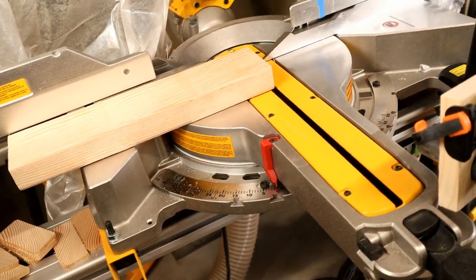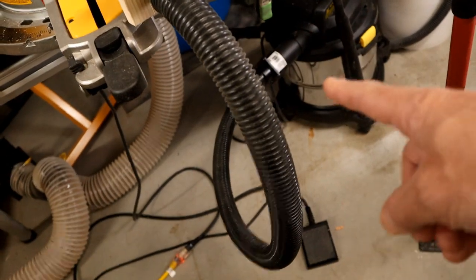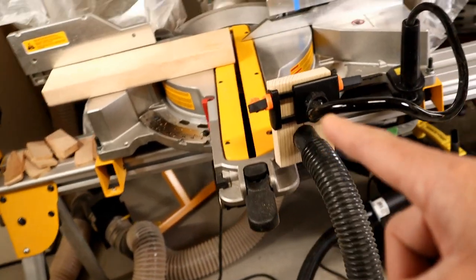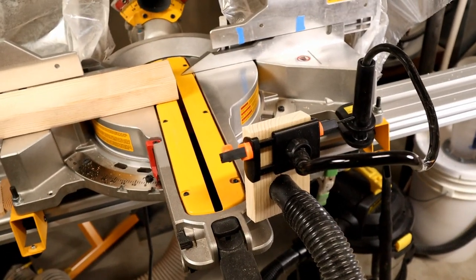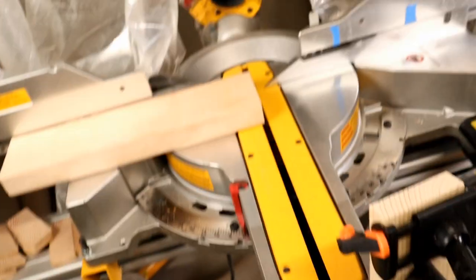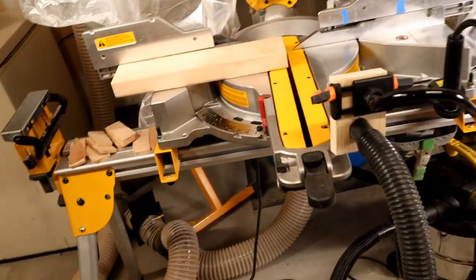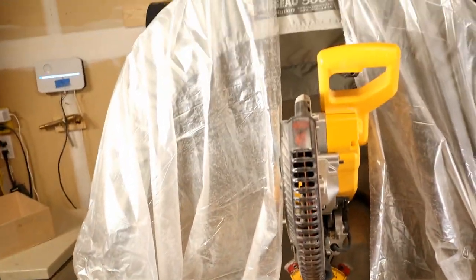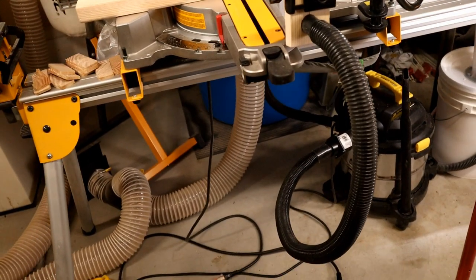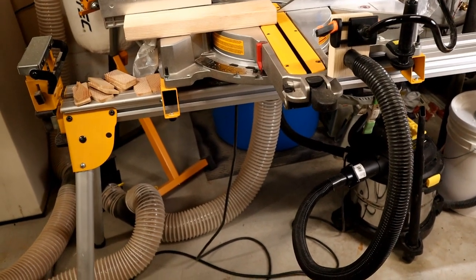It could probably be tweaked to be even better, but I just wanted to spur your imagination. Show you how you can use the free energy you already have in your shop from the exhaust port of the shop vac — get another hose, get a selfie stick. Who would have thought a selfie stick could help you with dust control on your miter saw? It might look a little goofy but it's not in the way of the cut, and it's going to keep your shop nice and clean. Hope this helps you on your dust control journey. Thanks for watching — I'll catch you on the next video.